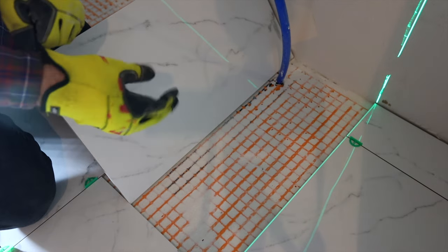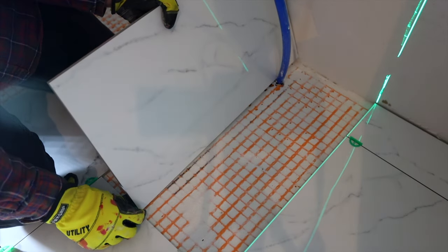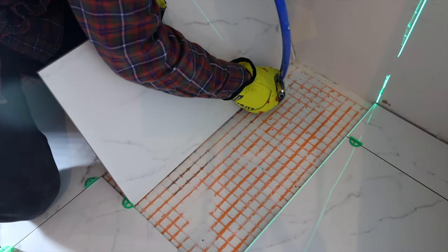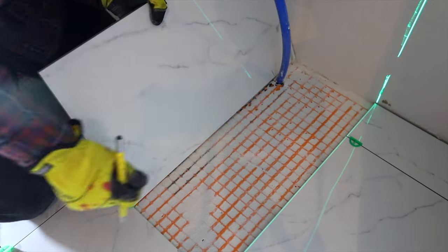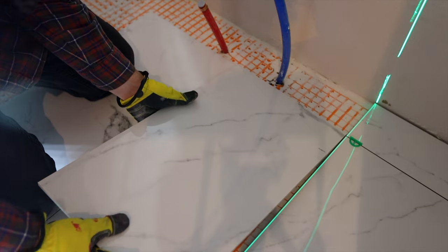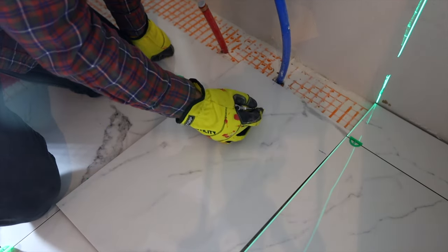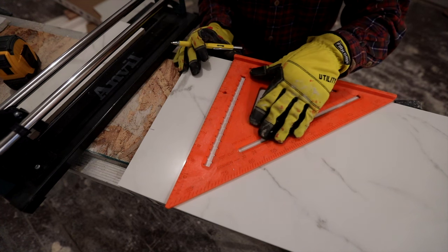For drilling the holes for the water lines, it's the exact same process. Put your tile in how it's going to go, put your shim in, smash it tight, take your marker, and mark the center line. Since my hole saw is oversized by a little bit, I do the center line in both directions, then use a square to get the intersection point. So you've got two marks — your intersection point.